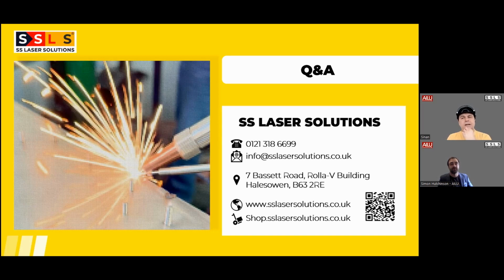Angle controlling, we have some projects which are going to be attached to the nozzle, but it's not there in the market yet. But it's not that problematic to keep your angle because that angle is not very specific. What we say is around 45 degrees, but this can be minimum 30 degrees, maximum 70. That's the safe zone. Why do we say it's safe? Because when this is your material and this is your torch, when you have an angle, most of the power is going to be absorbed by the material, and there might be some scattered light going at different angles, but generally in this direction.